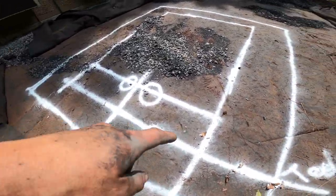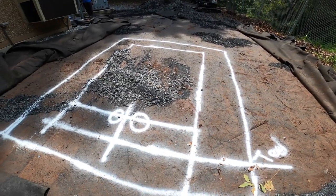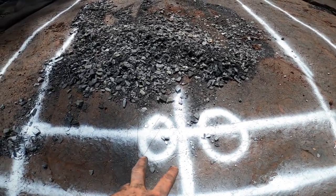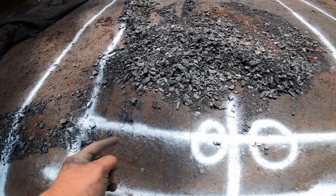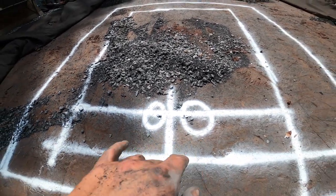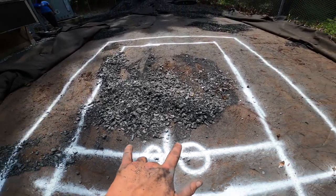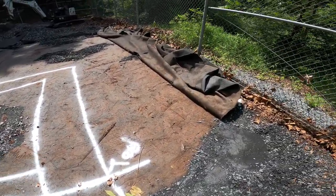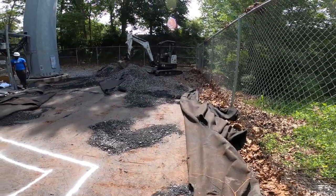Now, the inside box, that's gonna be where the platform is gonna be. Again, 5x7, and our pipes, we have been bringing them up 12 inches off the front, 15 inches into the side. Well, Chris, the electrician, wants me to try to bring them up in the center, right next to each other, so that's what we're gonna do. And our path of utility run is gonna be a 90. And basically, we're gonna put probably 20, 30 feet of pipe in the ground.